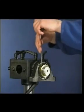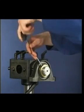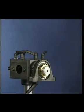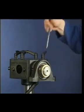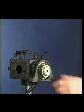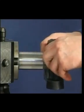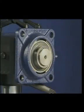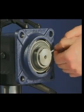To dismount a Y-bearing unit with an eccentric locking collar, loosen the grub screw. By using a hammer and drift, unlock the eccentric collar, and with the bolts removed from the housing, the unit can now be removed from the shaft. The dismounting of Y-bearing units located by grub screws is even simpler. After loosening the 2 grub screws with the housing free, the unit can be removed.